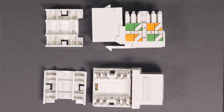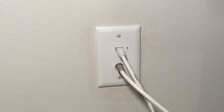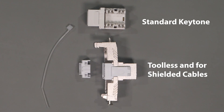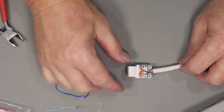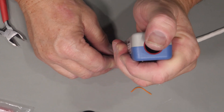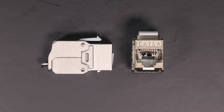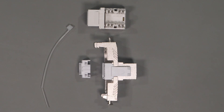Shifting to keystones — these are usually used for in-wall configurations and patch panels. If you're going to run an Ethernet cable in your home or business you'll most likely want to use one keystone on at least one side, to terminate the cable at a wall plate and provide your devices a place to plug into. The main differences are tool and tool-less configurations, as well as shielded and non-shielded versions. Most require a punch down tool to install the wire correctly. If you're installing Cat5e or Cat6 this should be sufficient, but if you're running shielded cable like Cat6A, Cat7, or Cat8 you'll want a shielded keystone jack. Shielded keystones tend to be much more expensive — typically larger, made of metal, and providing a way to ground the cable.